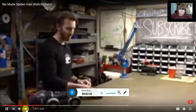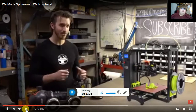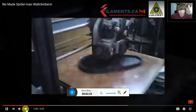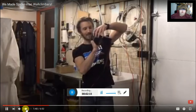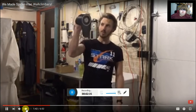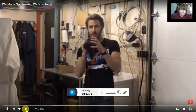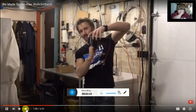Now the next step is making the handle. We'd like to use our 3D printer, but we're not too sure if the part will actually be strong enough for me to hang on. So we printed a prototype, and we decided to give it a shot. We want to test this to make sure that the layers don't delaminate when hanging this way. It's super strong this way because the shear strength of the 3D printed part along the horizontal plane is really strong, but in tension is typically a bit weaker because of delamination.